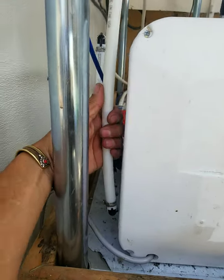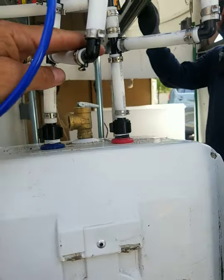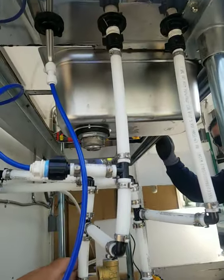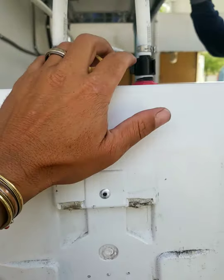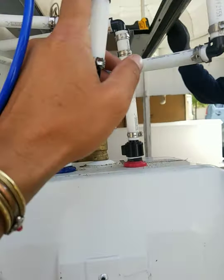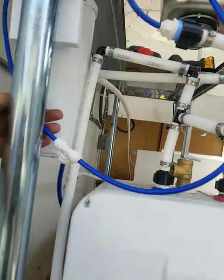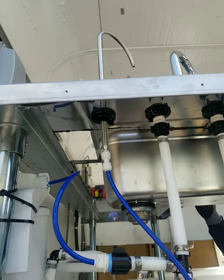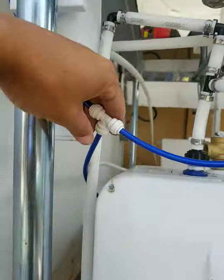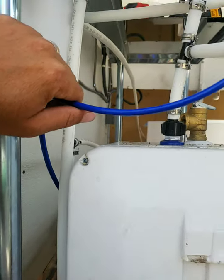Triple sink and the cup washer — the rinser cold. The water heater cold splits right before the heater to the hand-washing heater. Right before hand washing it splits to the filter. Filter comes up, filter splits to the spigot or faucet, splits again to the espresso machine.